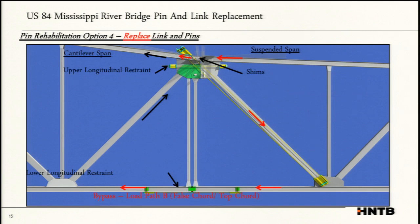Load path B. So in the event this contractor has got some PT bars, these are about 1 3/4 inch diameter bars, if he bumps into one, knocks it, or we lose one of those, we were going to have a secondary load path. And our secondary load path was to take the false chord on the bottom and make it a member that's part of the bridge, and also tie the truss in up at the top. This way it would be prevented from moving